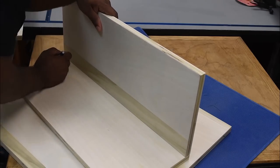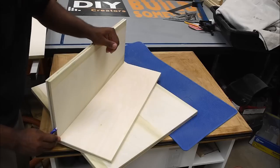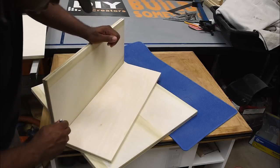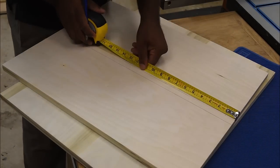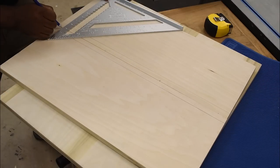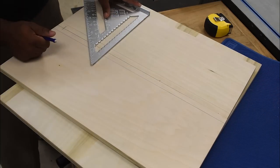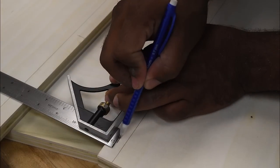Hopefully I didn't get criticized too much for using screws in this build, but the reason I'm going with screws is to help viewers who have fewer tools and want to tackle these builds. What I just did was take a sheet of plywood and mark its thickness to the bottom side of each plywood piece — these will be for the arms. Next I'm going to mark both pieces at the same time to keep everything uniform for the screw holes.